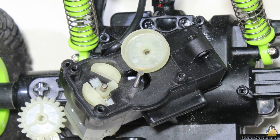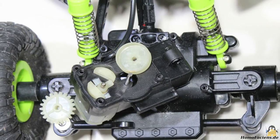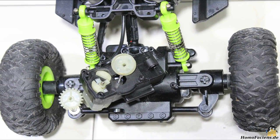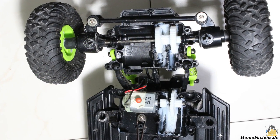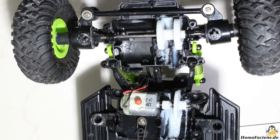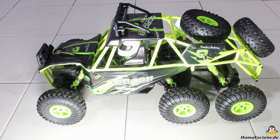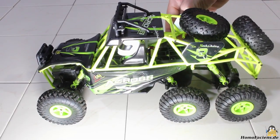Looking at the mechanics of the steering, you can see that the motor is connected with the gears through a centrifugal clutch. That protects the motor as well as the gears against mechanical overload. The wheels of each axis are connected through a straight rod driven by a geared electric motor, and all three axes are spring mounted on the chassis.